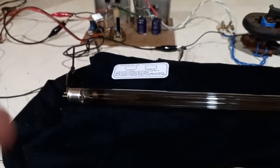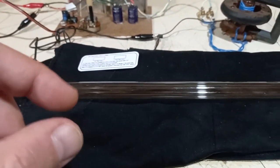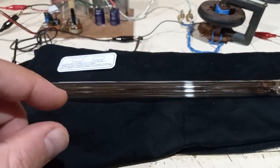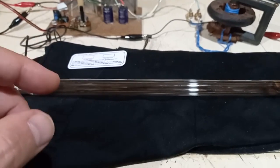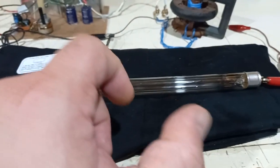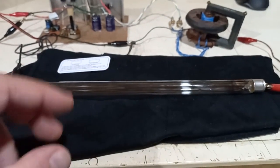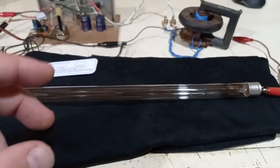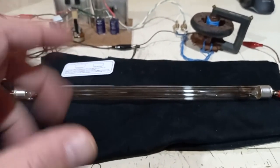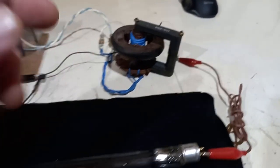We're going to make standing waves in the plasma of a gas discharge tube. These standing waves are visible as spheres, or knots, inside the tube — basically ionized gas that organizes into concentrated spots, thanks to a linear resonance inside the tube linked to its length. This resonance happens at a specific frequency or a harmonic of it, given by the high voltage supply that generates the plasma.